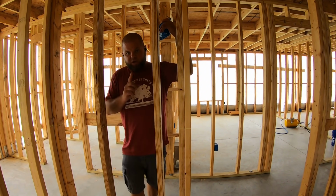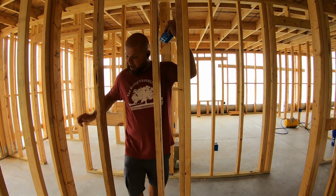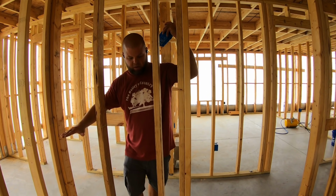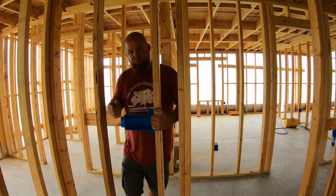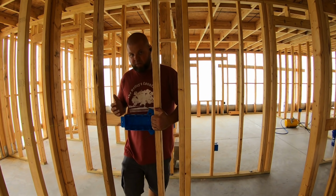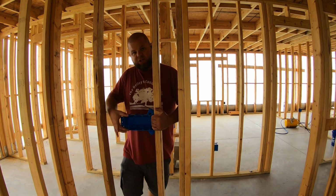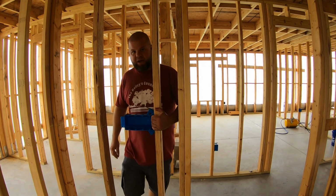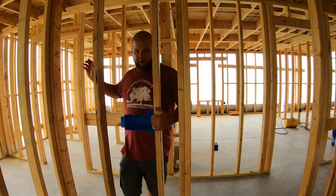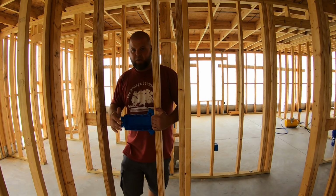So I'm gonna need 1 switch to turn on a main light in the bathroom, a 2nd switch to turn on a vanity light. The vanity is right here, so this is very convenient to everything. I'll need a 3rd switch for the exhaust fan. It might as well be right here where the wiring's really easy to get to. And I've got a 4th location in this box. I really need to put a GFI outlet. So if you're going to want to plug in a hairdryer or something like that in here, although Tiffany has her own half bath or get ready room, you never know if you're going to have company that may need to get ready in here.